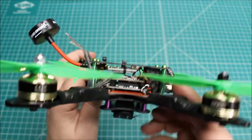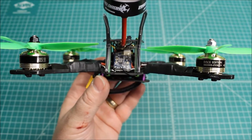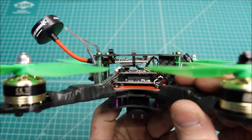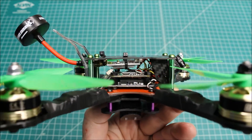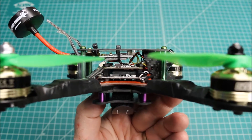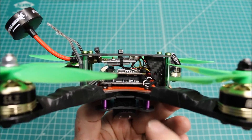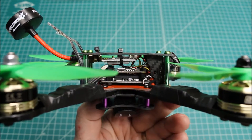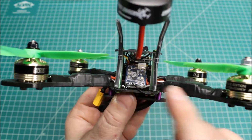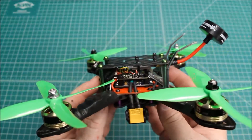I flew this today, and this is a really clean flyer. One thing I did a little differently — by the time I got everything mounted in there, I was still struggling with the VTX. I had it the way I normally have it, with the label facing up and the controls facing underneath, but the thick plug was just in the way. I had the receiver underneath there and it just didn't work. So my solution was to mount it in the back, and it's actually a really great place — the wires just come right out of it, no issues, and it's super secure.